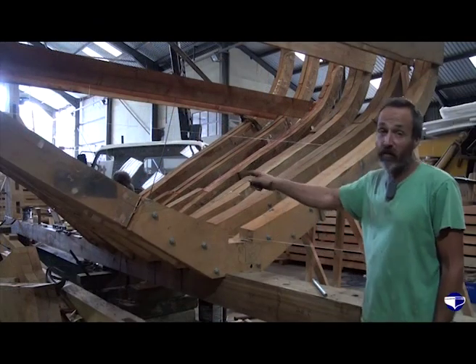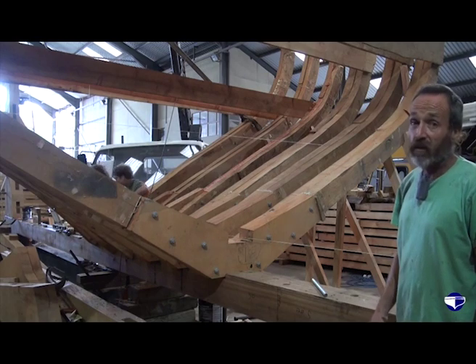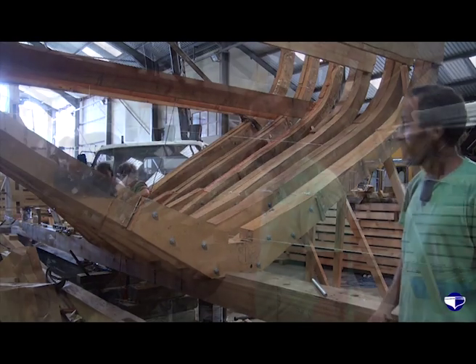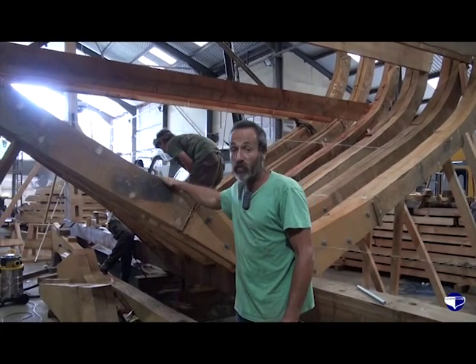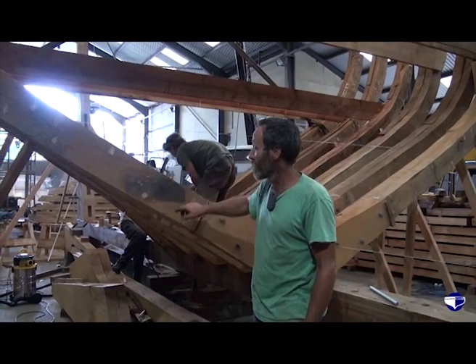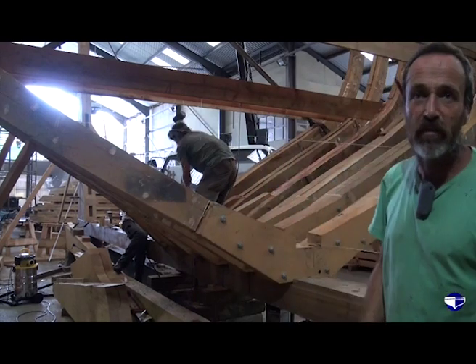These three first ones here are the midship frames and they're a bit bigger and heavier than the others because the mast goes there — it's a requirement. Since we last looked at it, this is all trennel fastened. All the futtocks now, which were just glued before, they will dry a bit. We've now fastened them all, and you've got a bit of film of that.